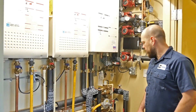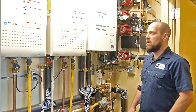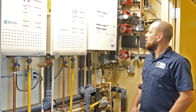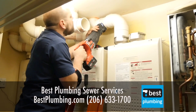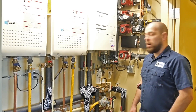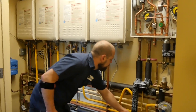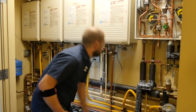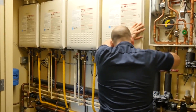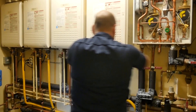Today we're working on a hydronic system, converting it from a tankless water heater setup. What it boils down to is there's not enough gallons per minute going through this — it's flow, and that's a heavy part of the equation. Without flow you don't have the BTUs. The water is carrying the BTUs through the floor, so if you don't have the flow going through there, you don't have enough to heat the building.